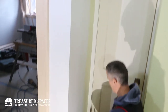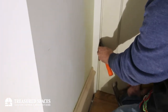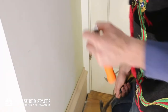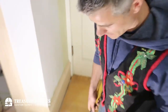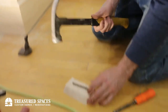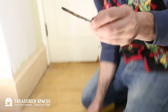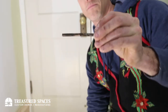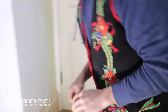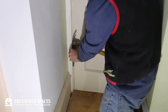So I'm going to take the bottom hinge pin out. I got the pin. I'm setting it down on the floor, just laying it on its side, and I'm going to tap it with my hammer and make it bent. It might be hard to see, but it's got a bend in it. All right, and tap it back in.